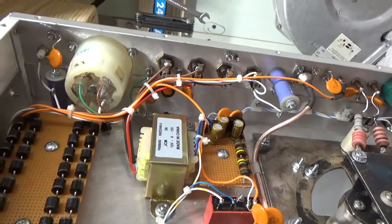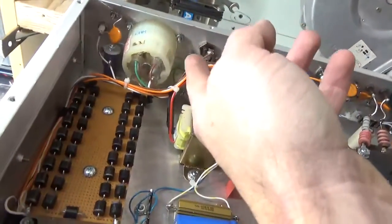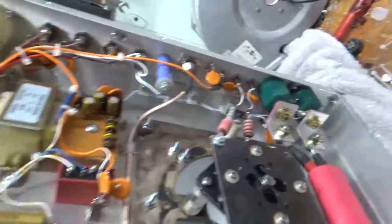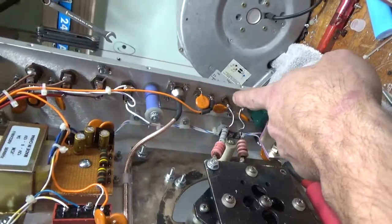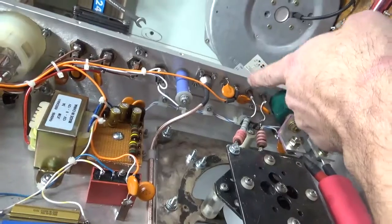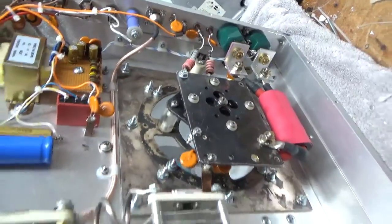The cathode return is fused, and so is the grid. Back here I also have two line fuses. You have the connection points to check the filament voltage, and then the chokes and the dropping resistors. So if these were ever shorted together, you won't have the full potential of the filament transformer shorting the two terminals. If one were shorted to ground, it'll just bias the tube on. All Teflon wire down there.